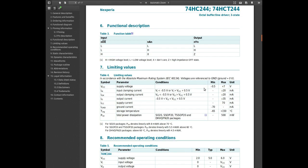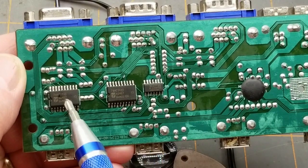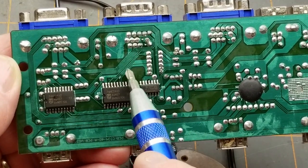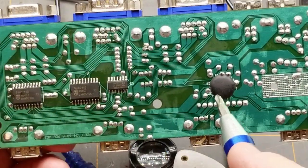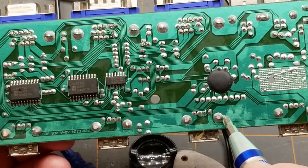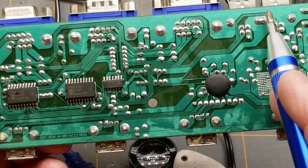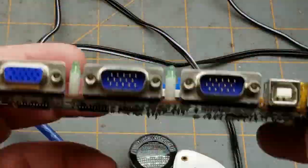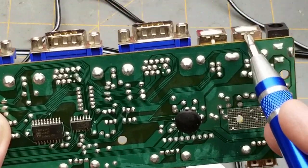I could have figured this out from the board too, but it confirms my guess. These two 8-port line drivers have traces going to the VGA connections - no surprise there. The USB magic is happening under a glob top. There's a pull resistor - actually that's the ground point, so the resistor is pulling the USB lines down. And there's our output... there's a six-pin - oh, that's the switch. Is the USB just being mechanically switched? Because this is the two USB outputs going to the two different computers.